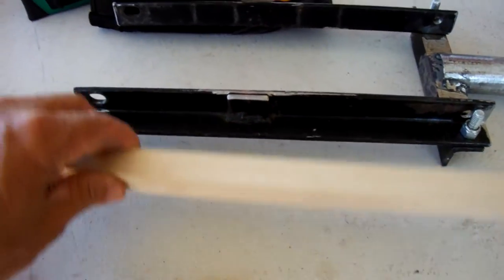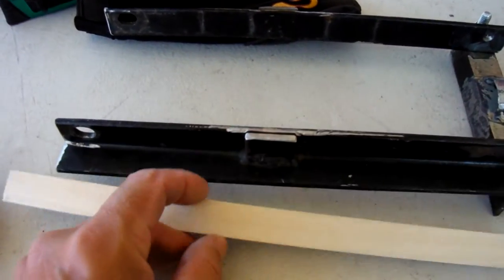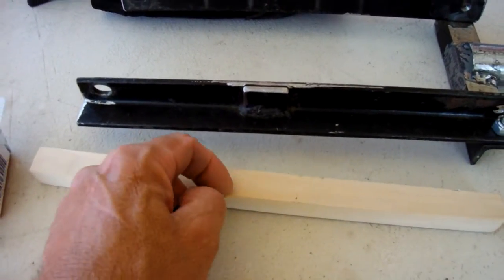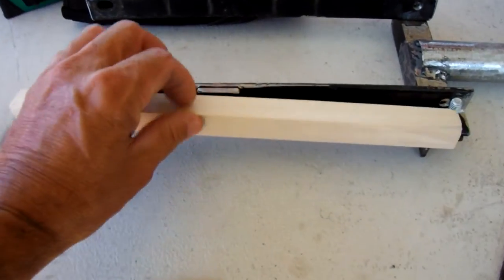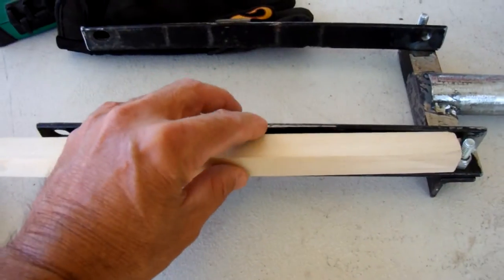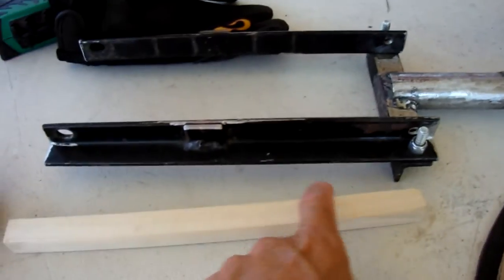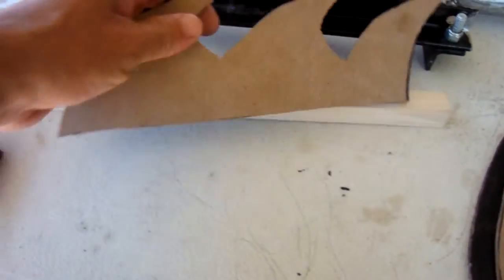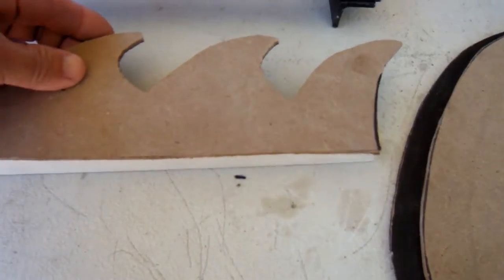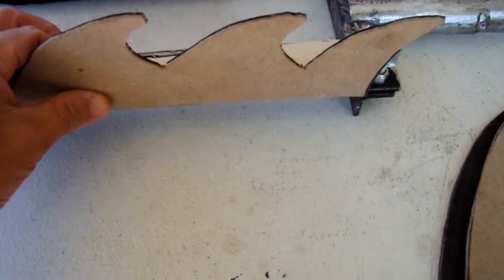This is going to go here. I don't know. I'm going to have to cut out a notch here or something. Somehow figure out how to cut out a notch. I think I got a wood chisel. I can chisel that out so that it'll fit flush against there. And then I'll screw in the self-tapping screws. First, I'll drill the holes in the wood and the pilot holes in there, and then this will go on the edge like that. So what you'll see will be like that.